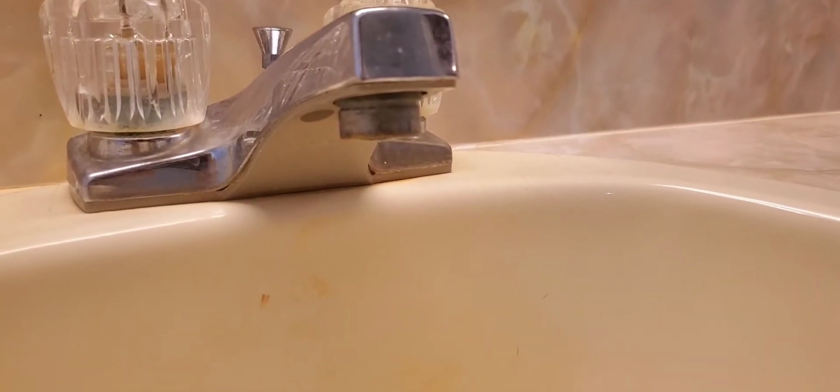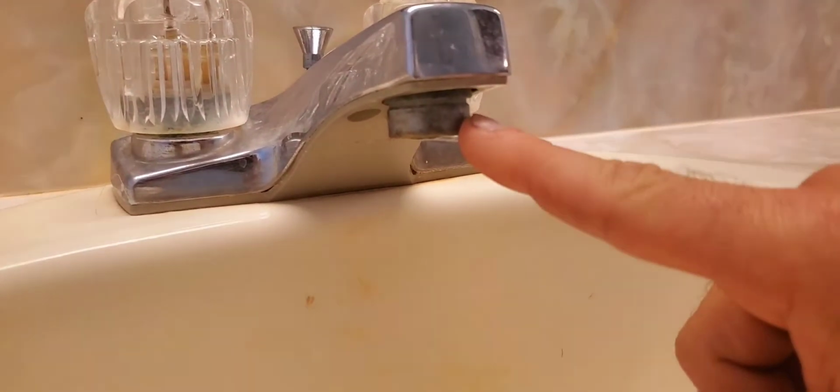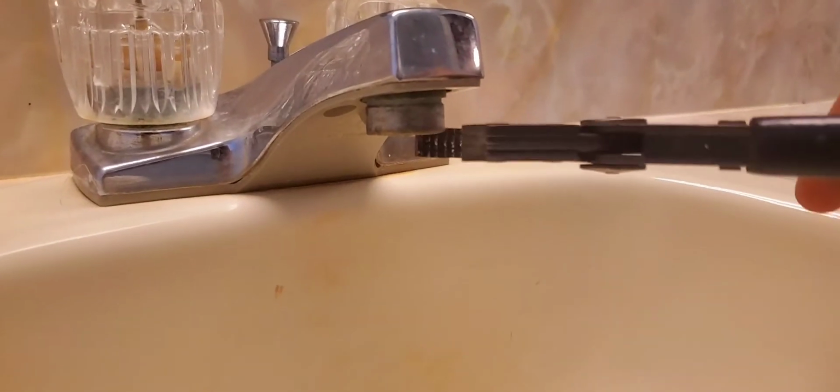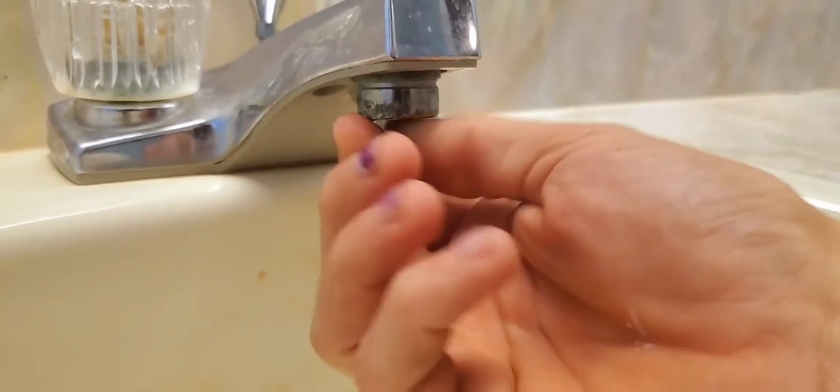So low water pressure in your house, you might have great water pressure in other areas, but say low pressure at your sink. Typically what you're going to want to do is unscrew this. So we're going to take our channel locks, I'm going to grab it, untwist it, and spin it out.